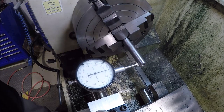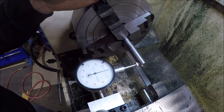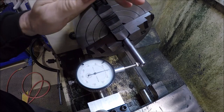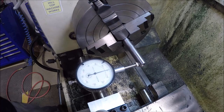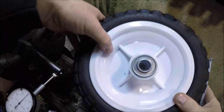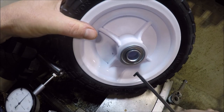I was trying to keep it simple, but if I make 2, then I've got to press one on and then slide the axle mounts on and then press the other one on. So basically the mounts are gonna be captured in between the 2 bushings. So didn't think about that. I think what I'm gonna do is go ahead, like I said, make 4 small ones. So what we'll do is move you over here, we'll make 4 small ones and they'll just go inside the bore of the bearing.